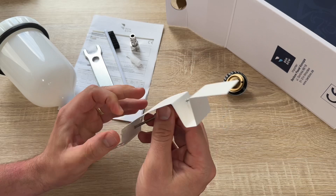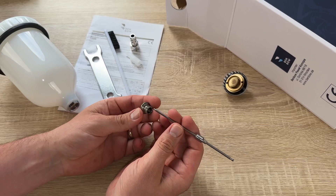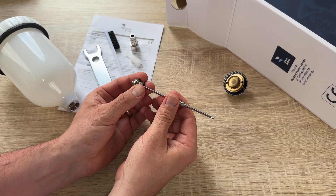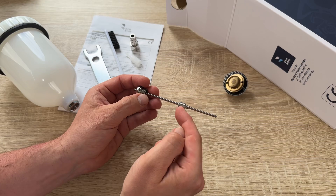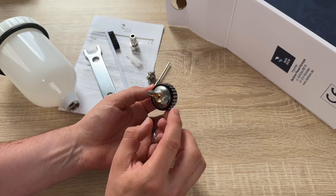As you can see, it's a good paint job. You can do a wide range of nozzle shapes and sizes. The consistency of the paint can be varied, and the shape of the workpiece and desired spray pattern are important factors when choosing a nozzle. The three most common nozzles are the full cone, the hollow cone, and the flat stream.